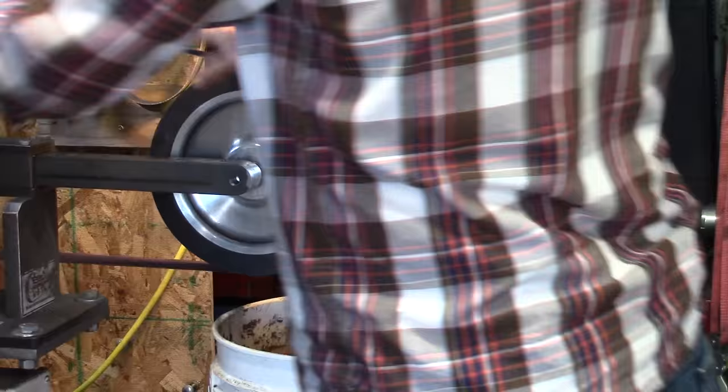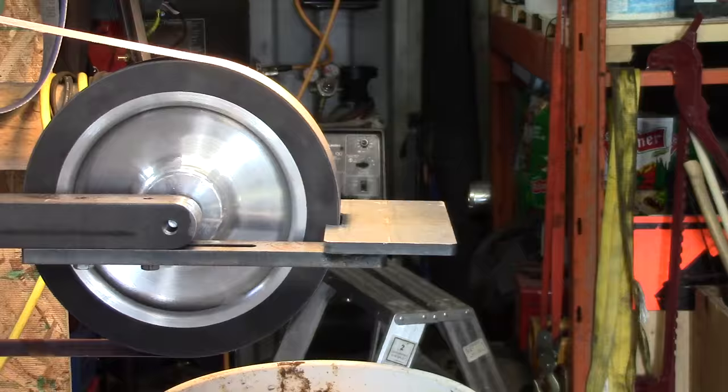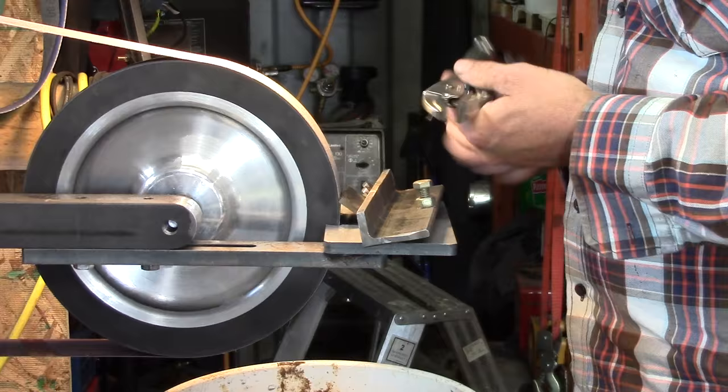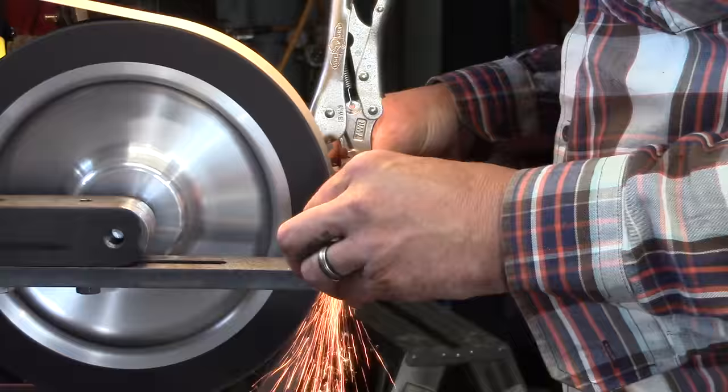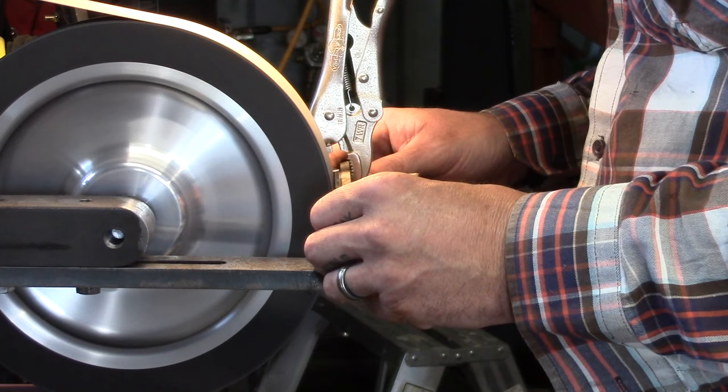You also need some material there for your final sharpening when you're done. For this knife we're going to use a hollow grind, so I'm putting on the 10-inch contact wheel. This is my homemade beveling jig — just a piece of angle iron with a tapped 3/8" hole, a bolt through there, and a locking nut so I can set the angle and lock it in position. Then we start grinding — this is the part I really enjoy about knife making.